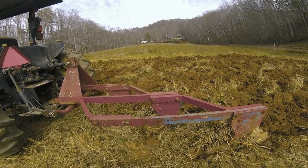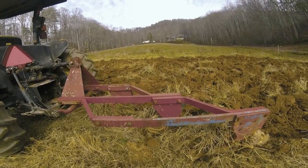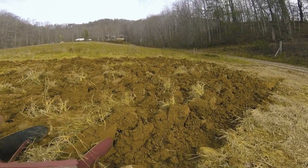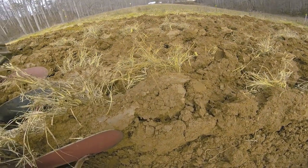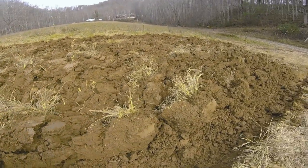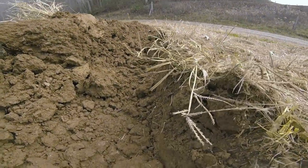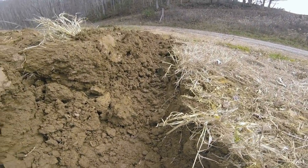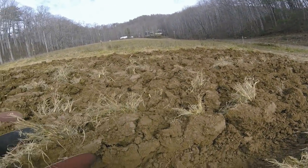So let's see if the John Deere is pulling it, but not good. The ground, you can see it's a little wet, but it is breaking up. Anytime it'll break up like that coming off the moldboard, you're all right, particularly this time of year. You can get by with a little more. And you can kind of see the depth that we're plowing at. It's pretty close to 7 inches. Wouldn't miss it by much. So let's plow a little.